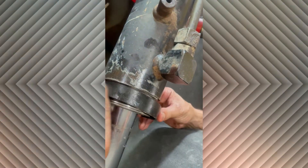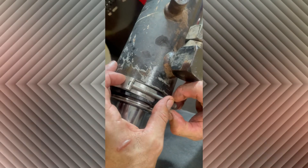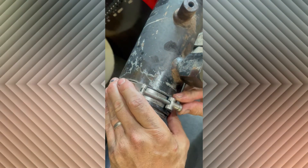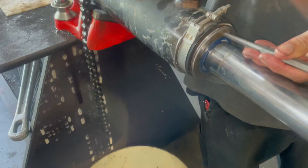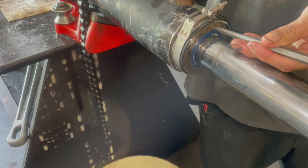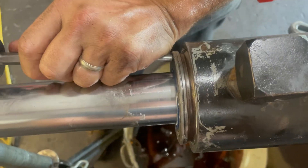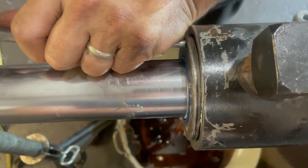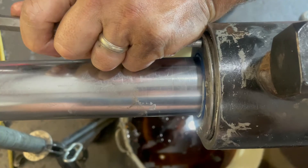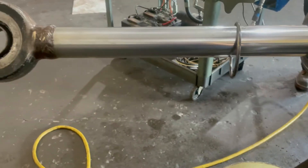Here's a little trick — he uses a wear band with a hose clamp to compress that ring to get it to go back in. I've seen guys use two screwdrivers, one guy holding and the other one hitting the gland, and it just never ends well. So this is the best and safest way for everybody involved to get that ring back in there. In order to get that ring to sit into place you have to knock it back and then use hydraulic pressure to push the gland back out, and that snaps the snap ring back into place.